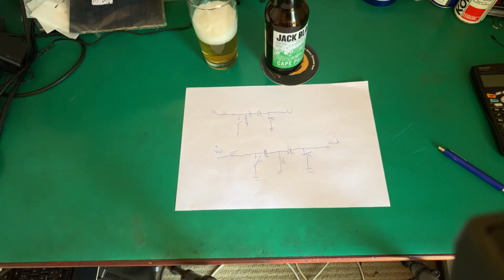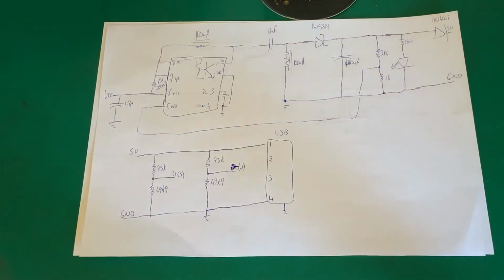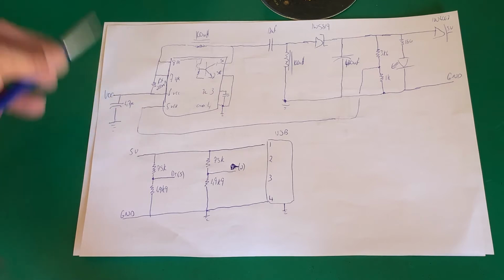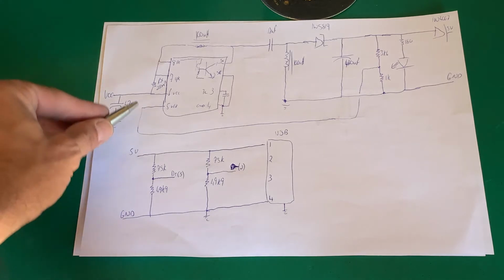Let's set the shot up, and we'll come back to our circuit that we've designed around the MC33063. So here's the circuit I've put together around our MC33063. Not very amazingly complex, not very difficult. We have a supply, in this case anything from 3 volts to, we've actually designed for, 14.7 volts.